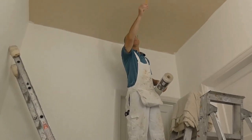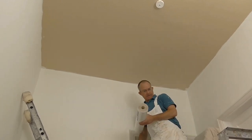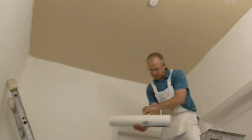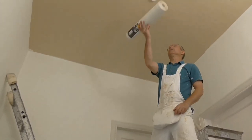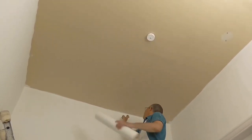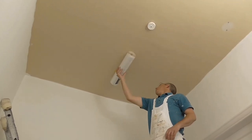Ready to mark out this ceiling. And obviously, as you can see in the centre, there's the light. With this being a square pattern, if possible, I'd like to get a square more centralised in the centre. It's difficult, but on this paper you've got a dead centre and then a square that's offset. So first of all, I tried it dead centre, and then when I'm working this way, I'll end up where there's a little strip, which is no good. So going off the centre of the square on the left side, it works out a lot better.